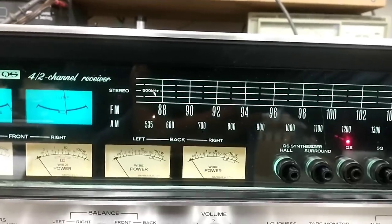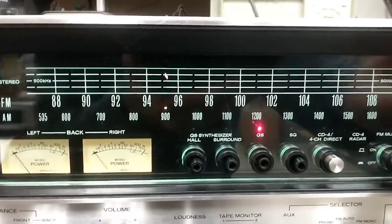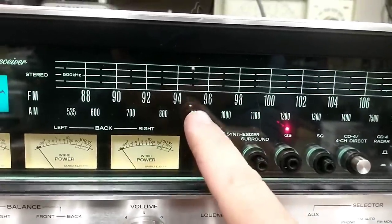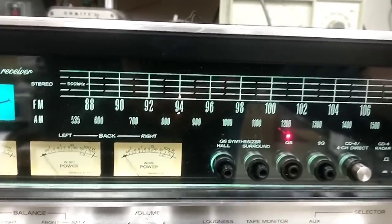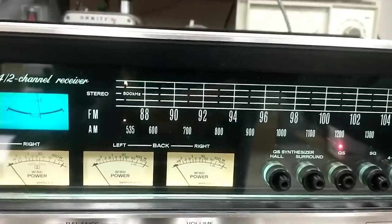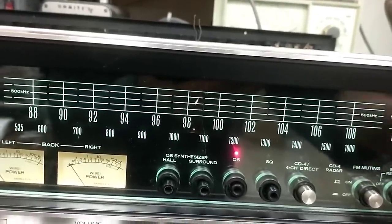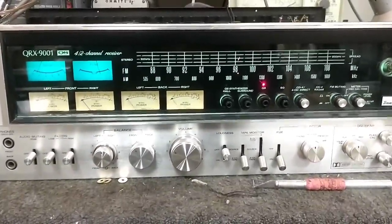So as you move the tuner, see how your little sine wave thing — that's why you need all the pointer illuminated there. Kind of cool though. Now this pointer is slightly longer than stock, because normally you wouldn't see the little bit protruding here at the bottom. But this is actually better, because then you have a more precise view of the tuner dial as it hits the number. So I like that better actually. Even the marks line up — so that's even better. So I'm happy with that. 98.5 is where my alignment generator is, so let's do a basic tuner alignment on it.